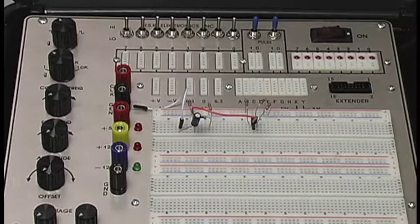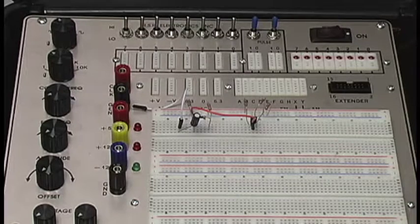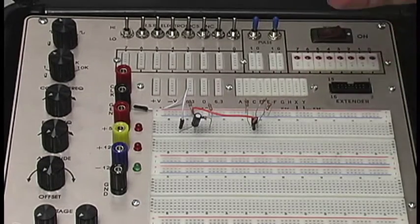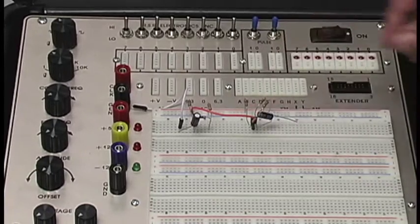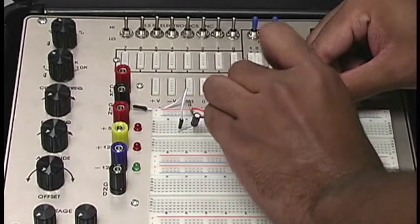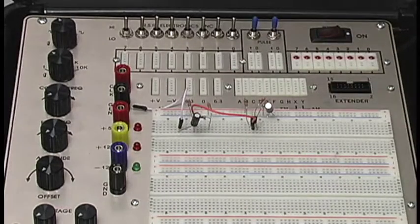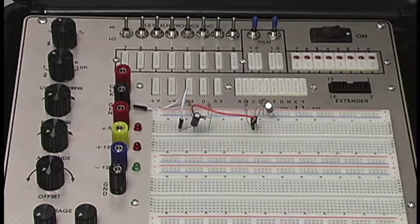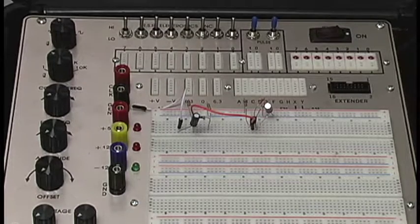And then lastly, for our first half of our circuit, essentially, if you remember, we also had a 4.7 microfarad capacitor in parallel with our 1.5K resistance as well. So what I'll just do here is on the same row as our emitter pin for our BJT, hook it up here on this side. And then also hook that up to our negative, our grounded voltage strip. Okay. So with what we have set up now, this is just the first half of our circuit here. That's most of the nitty gritty, really. Yeah. Okay. It's pretty much smooth sailing from here on out, right?